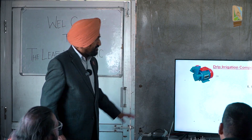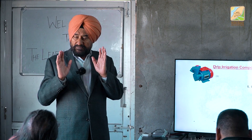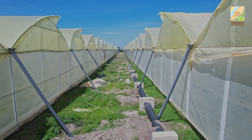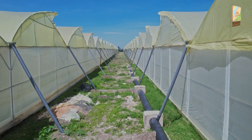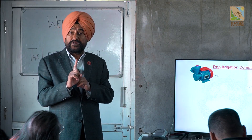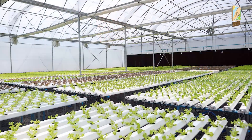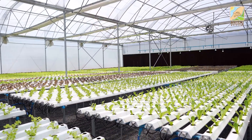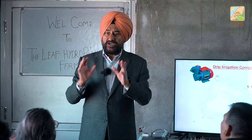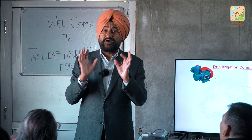We will show you what manifolds are. Many people use very high horsepower motors unnecessarily. To my mind, for eight acres of a polyhouse you need just one and a half horsepower motor. Show me any farm in this country using that — every farm is using seven or ten horsepower unnecessarily because the consultant has misled them. One and a half horsepower motor is sufficient to irrigate eight acres of hydroponic farming.